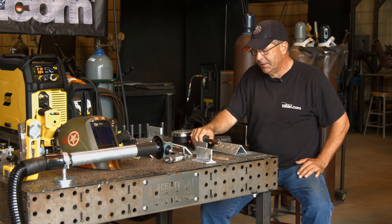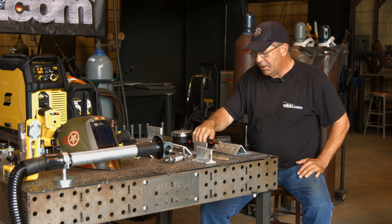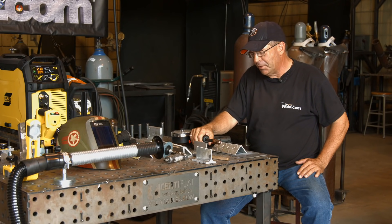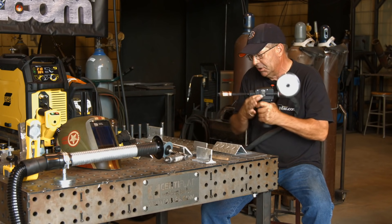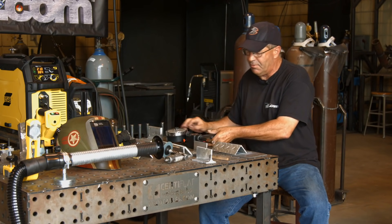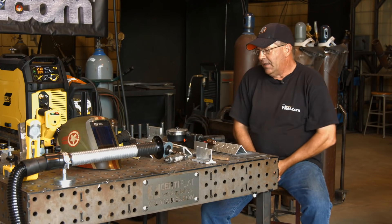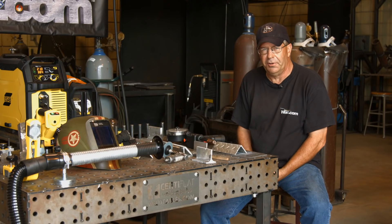I need a little help folks. A while back in our classes we did some aluminum work on a spool gun. I've read some comments over the web and some people don't like spool guns, but I actually think they're kind of cool when you get past the cumbersome part. They're a little different - there's a little weight, cable, spool. A little tougher to manipulate than a regular MIG gun, but if you want to save some time on some long seams, I find it more beneficial than TIG. Obviously TIG looks a lot better, but for doing long seams you can really put some material down.